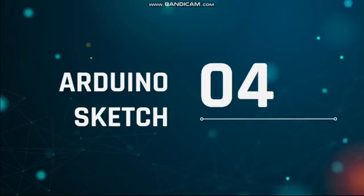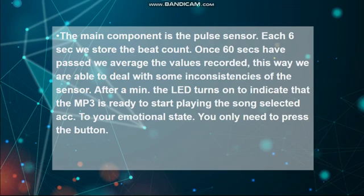Arduino sketch. The main component is the pulse sensor. Every 6 seconds we store the beat count. Once 60 seconds have passed, we average the values recorded. This way we are able to deal with some inconsistencies of the sensor. After a minute, the LED turns on to indicate that the MP3 is ready to start playing the song selected according to your emotional state. You only need to press the button.